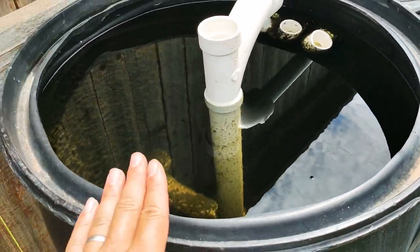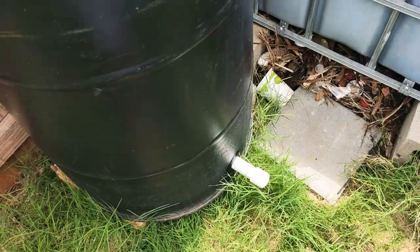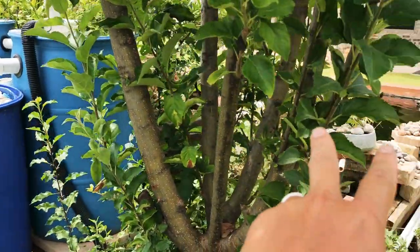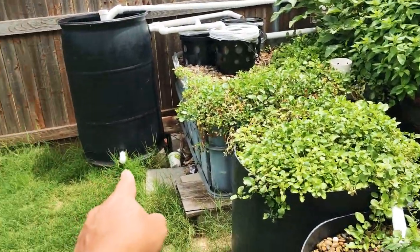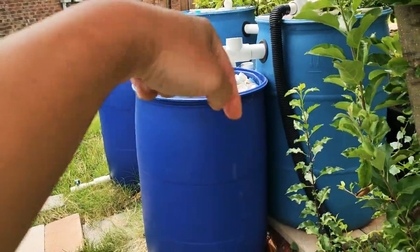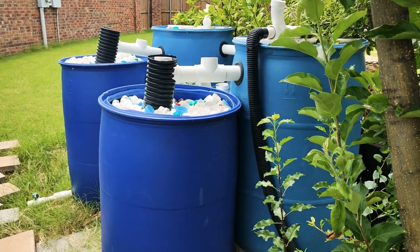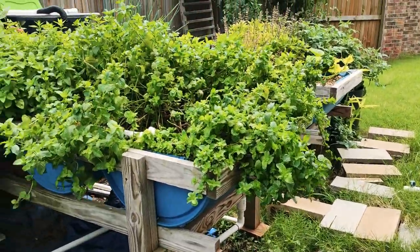I clean the paint strainer maybe once a week. I also drain this barrel here that contains all the fish waste — once a week too. All you do is unplug the cap and let it drain all the way down. I also drain these four barrels here once a week too. These four barrels get the water from the skimmers — skimmer right there and skimmer right there. I take a broom and beat on all the caps, then unplug all the caps and let that drain. It takes about ten minutes to get all this clean and clear. You see so much fish waste come out of those barrels, and ten minutes without getting your hands dirty at all.